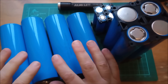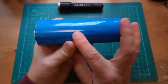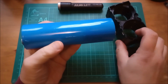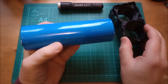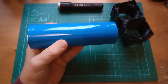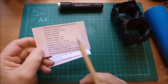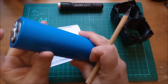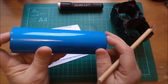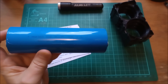Now, these ones — things are a bit more tricky. They say on them SIB, sodium ion battery, 46145. And I did actually manage to track down some 46 millimetre holders, but this is actually 47 millimetres diameter — I think that's actually in the spec. Yes, here it is: size 47 by 150. The length depends on where you measure it; to the end of the studs it's more like 160, but to the cylindrical part it's more like 145 millimetres.